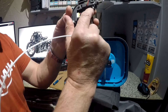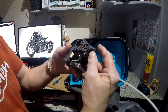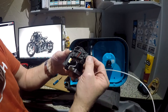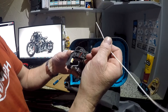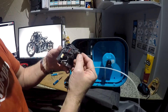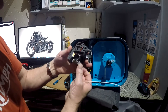That's the tension screw for your gear wheel - it controls the pressure on how much it's forcing the filament through. If you don't have enough tension it'll slip; if you have too much it tends to chew your filament up, break it, make it rough, and then when it tries to go into the nozzle it makes it harder. So now we've got to take these off.